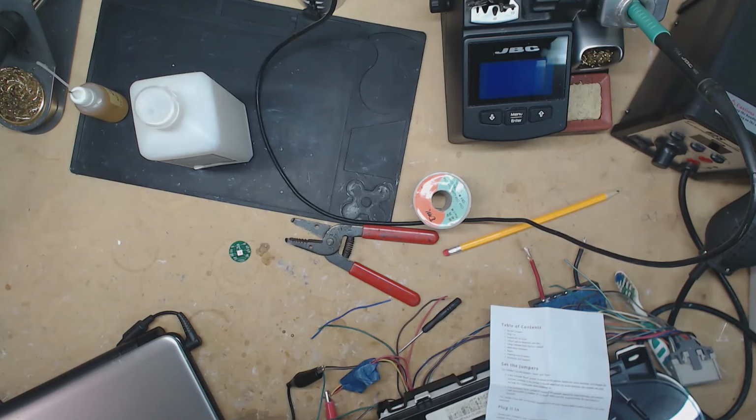So to be a professional shop that actually has your own building to do it out of, you really ought to be to that level of work where you're not just replacing single stepper motors and just replacing the burnt out bulbs, because they were what, two bulbs that had been replaced on that and two stepper motors. I mean, that's definitely not A plus kind of work. So, to be fair, they may not have done the crappy solder work that was on those resistors on there, but the work done to the stepper motors, that's really just not right to do as a shop.